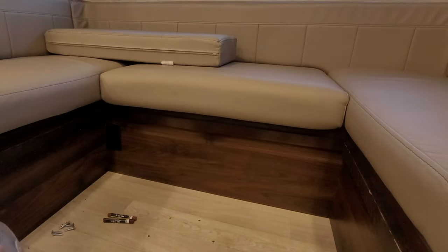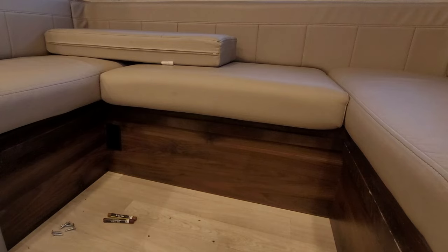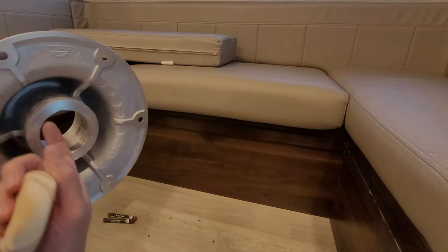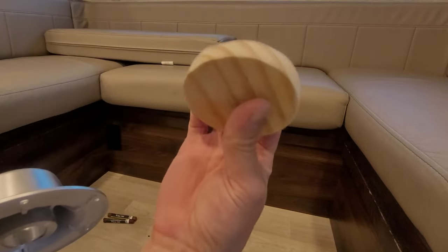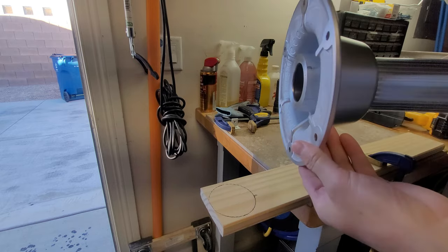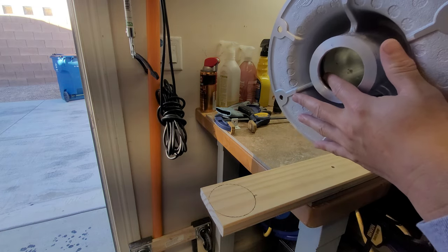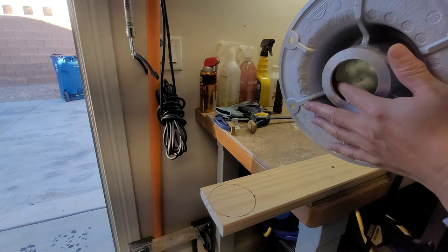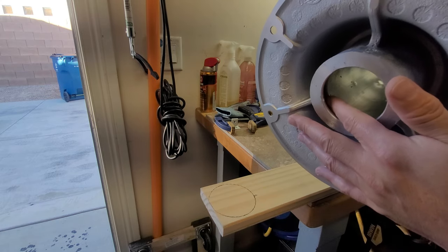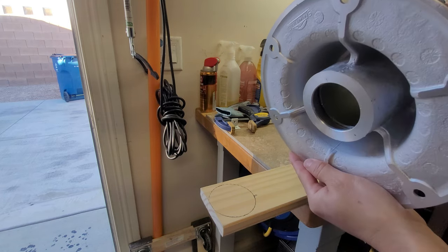I'll separate these off camera. Now that I've separated this, what I did was make a filler piece about three-quarter inch thick to put inside and cover the gap you saw below. Here's a glimpse of why this leg gets stuck — with the base removed and viewed from the bottom, the inner piece bottoms out before reaching the very bottom. The friction is way too tight the more pressure you put on. The more pressure on the table, the tighter it gets, and it physically gets stuck.